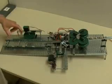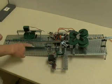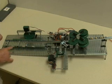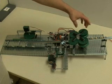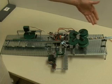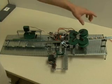Servo motor here, operating the area for the 3 different bins for the 3 different color marbles. We got wood in the front, we have steel bin in the middle, and clear in back. Over here we have a motor operating a gear system, very similar to a pitching machine. The different marbles are lined up in random order, and it's designed to spit a marble out one at a time.